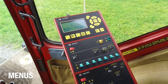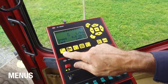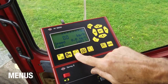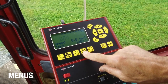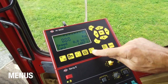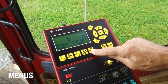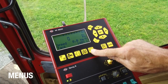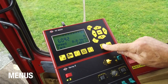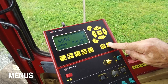Let's look at the HC5500. This line of buttons are presets. This one is the application rate. Here we have the velocity — the speed. Here we have the tank contents and the area sprayed, both relevant to register number 3. This one is for the total amount of liquid sprayed out for this register — it could be 3 or 4 tank loads. The last button shows how many meters or feet you have left before you run out of liquid. The final one is the auto button.